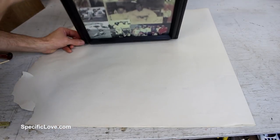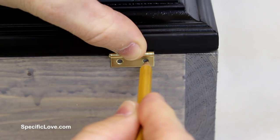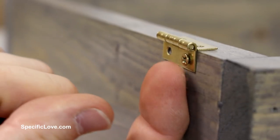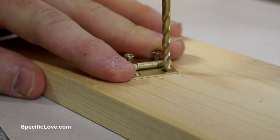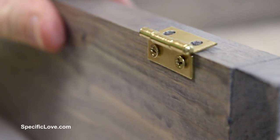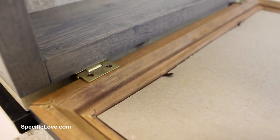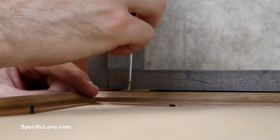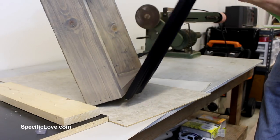It was now time to attach the frame to the front of the box. To do this, I used a pair of 1 inch utility hinges. I first test fitted the locations, and then using a small 1/16th inch bit, I drilled some pilot holes into the box. With the first screw in place, I realized they sat too high and would cause clearance issues with the frame. So using a 5/32nds inch bit, each of the holes in the hinges were enlarged slightly. With a quick test fit, they looked much lower. I then raised the box with a couple pieces of wood to align the hinges with the frame. The area on the edge of the frame is very thin, so I marked the location of the hinges and drilled a pilot hole for each screw. The screws were a little harder to install, but they worked great. The hinges fit snugly in place and pivoted well between the box and the frame.